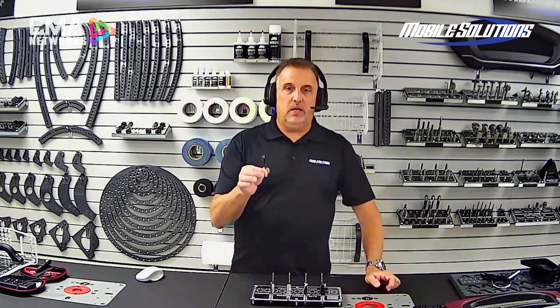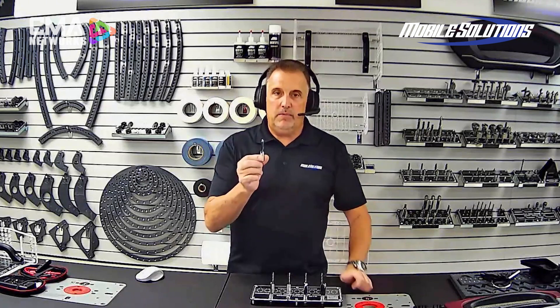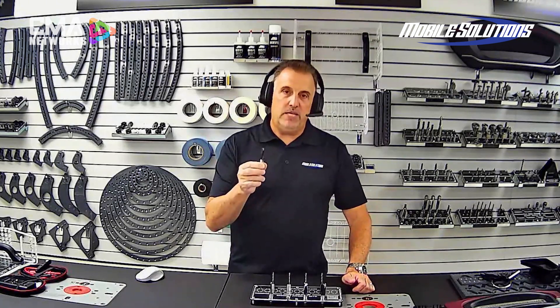What makes this so unique are the drill bits that come with it. The problem is, if you have a magnet that's maybe 3/8 size and you have a 3/8 drill bit, you drill the hole, you have to glue the magnet in and there's no actual mechanical compression. These bits are undersized perfectly, so you have to tap that magnet in with a rubber mallet.